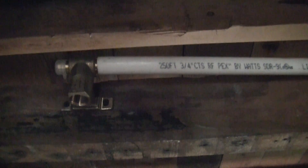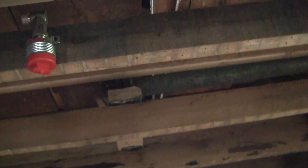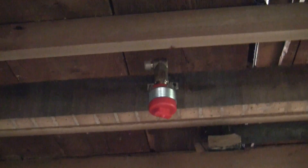It's a little metal ring that goes around the end of the PEX. But I'm taking the pipe down — this is just temporary — because they have to odor-seal the 2x4s. I just connect it with some standard plastic snap connectors and run it to the other room where I started, because I want to be able to cut the PEX pipe to the exact length. I go to the second position and come back, line up the PEX pipe, and cut it so I know I have the exact length.